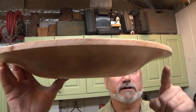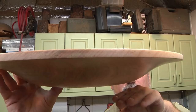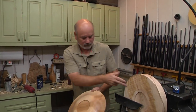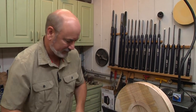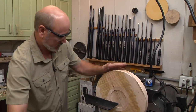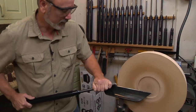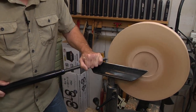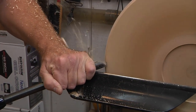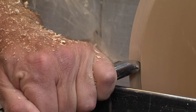The shape we're going to make now is the OG — ogee. It's a curve in, a curve out, and it goes to the bottom. It's a really classic shape and it makes the platter lift up off the table so it doesn't look as heavy. The first thing we want to do is remove some of the excess wood. I'm doing a push cut, anchoring my hand away from that spinning blank and just going in, taking a little bit of wood at a time — not a hero cut, about a quarter inch — because it's hard wood and it'll get jumpy.